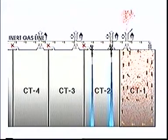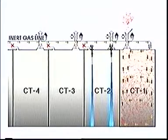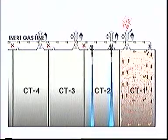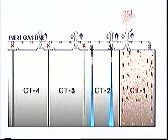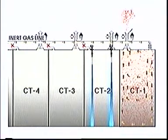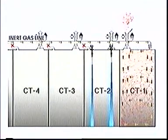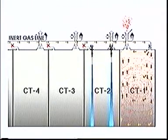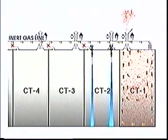The Butterworth hatches in the aft part of cargo tank number one are opened, and the inert gas is allowed to pass through the tank. There is great turbulence in the tank. Watch the pressure at the IG system. Keep a pressure of 200 to 400 millimeters. Otherwise, there is a risk that the IG fan will overheat.